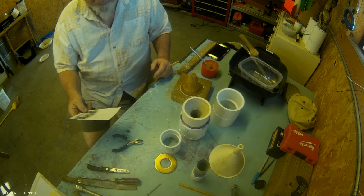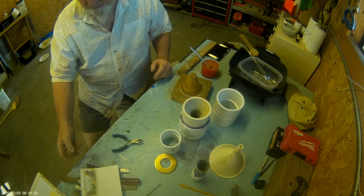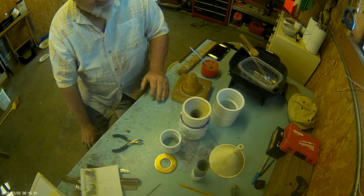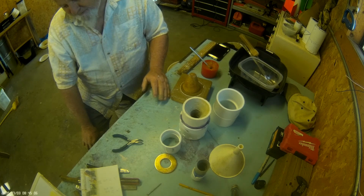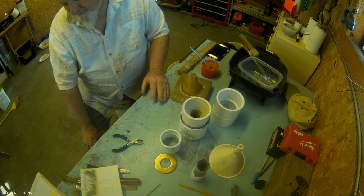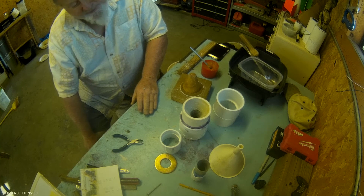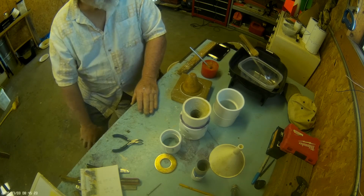And a 3-inch Schedule 40 PVC has a maximum operating pressure of 260 psi, which I'm 50 or 70 pounds above that. Almost 100 with the 1.3, but the burst pressure is 860 pounds, so I'm still in the safe area. I'm not pushing it too much.